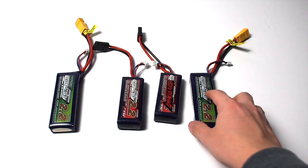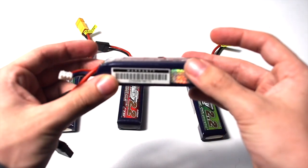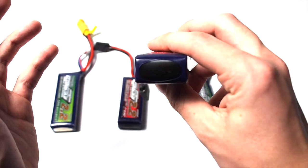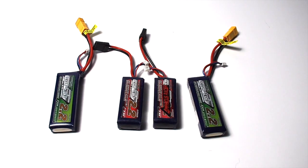If you're in that situation, you have a few courses of action. First, if you see any puffing at all, you could just order new LiPos — that's always the safe option. But LiPos are expensive and their lifetime isn't necessarily done. Puffing occurs naturally over time and isn't something you have to worry about if it's minimal. If you have relatively new batteries and notice some puffing, keep an eye on them and supervise them while charging.